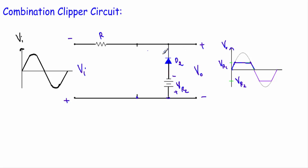With D1 removed, consider diode D2. The negative terminal is connected with the N-side and the positive terminal is connected with the P-side, meaning the input voltage is trying to drive D2 into forward bias. However, the reference voltage Vr2 has its negative terminal connected with the P-side and its positive terminal connected with the N-side, so Vr2 is trying to drive D2 into reverse bias. When the input voltage Vi is exactly equal to minus Vr2, the resultant effect on D2 will be zero, giving the transition voltage during the negative half cycle as Vi equal to minus Vr2.